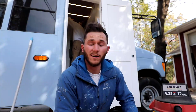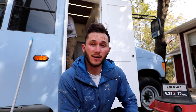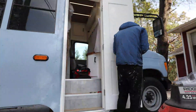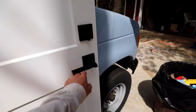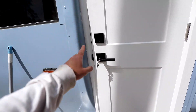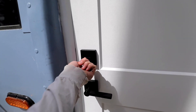I've put a couple coats of paint on my door and door frame. I had to do a little bit of trimming this morning to make sure it all fit and opened and closed nicely. Now I'm going to install my handle and my deadbolt, so hopefully this door is going to close and lock properly. I don't have any weather stripping yet but I'll have to pick that up at some point. I got some stuff at Home Depot that matches all the rest of my trim and hardware on the inside. And now we have a door handle and a deadbolt installed with a little locking button — deadbolt, same key.